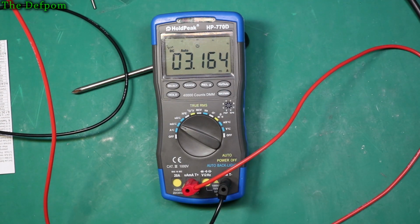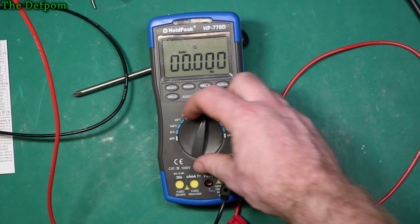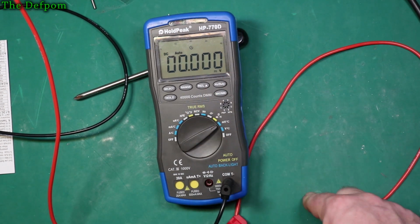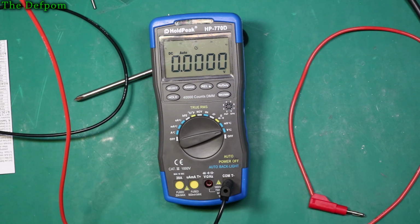And that's about 10 microamps difference. Siglent's saying 3.192 or so. Again, it's bouncing around slightly because it's right at the bottom end of what my power supply can be set to. Accurate enough. I do like the way it changes those around. That's a really nice feature. That will save a lot of people headache, a lot of accidentally blown fuses, that kind of thing, or shorted out supplies or whatever. We've all done it. That'll save people, certainly.